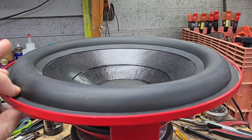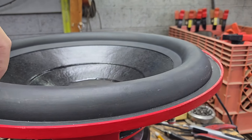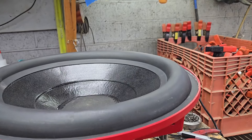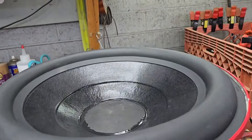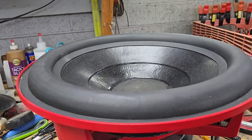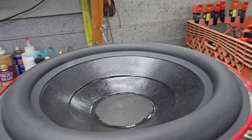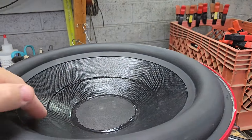At the time it was called a large surround because most of the surrounds back then were like only half inch. So I think this is actually 30 millimeter diameter, maybe a little bit bigger. This one I got from the Lord of Bass, and it was used by NCA Labs to build the Memphis LVS — or Elvis, as it may be called. And so it fits the Memphis cap in here, the Mojo cap, pretty well.